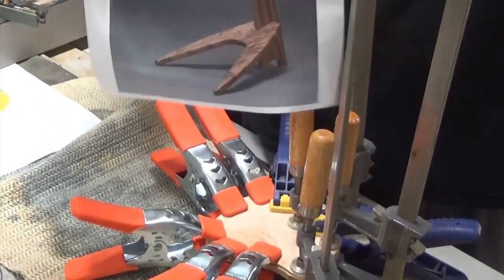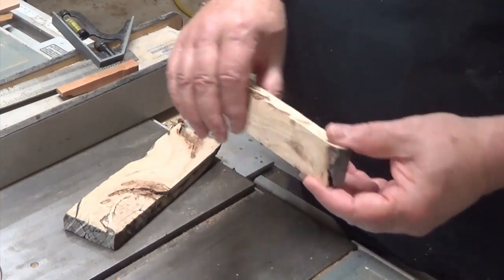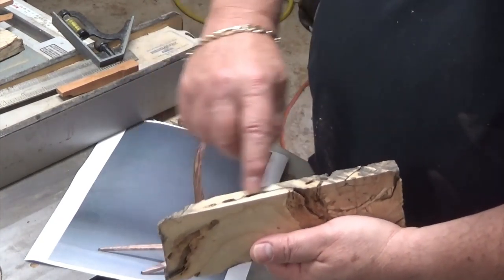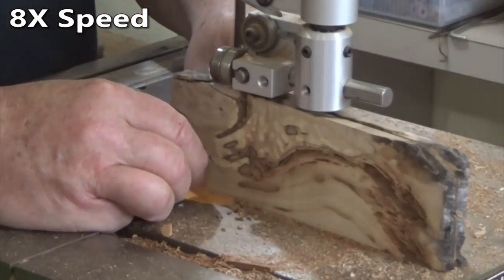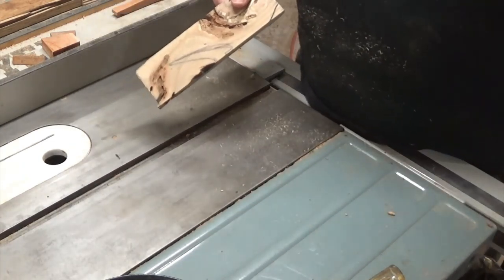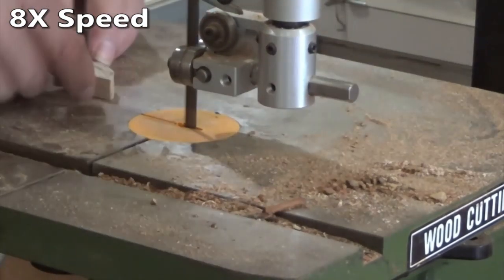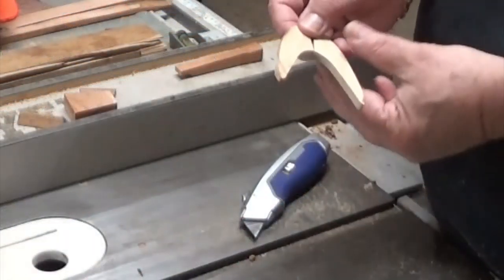While I'm waiting for glue to dry, I'm going to start picking out some wood to make the guitar stand. I found some spalted hickory that might look really nice — I'm going to use this piece for the upright and thin it down because it's way too thick. This piece I'm going to cut on the band saw, split it, and find some book match that I can lay open for this. No thumbs in the way. Now while they're stuck together I'm going to go cut these out on the band saw. Got them cut out — now I'm going to finalize the shape on the belt sander. And there you have it — it's bookmatched.